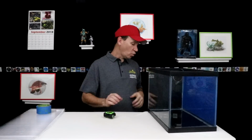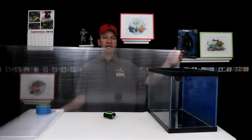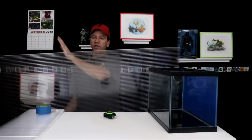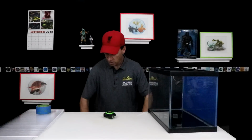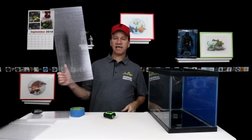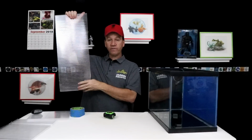So what you do is you set your guide on your table saw to 9 3/4. And so you take it and you make that first cut at 9 3/4. And you can just keep making them at 9 3/4 until you can get 10 out of it, okay? So this is what you end up with. This is a 9 3/4 inch wide by 2 foot tall.